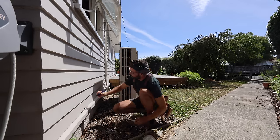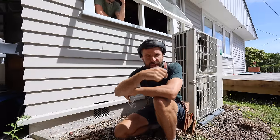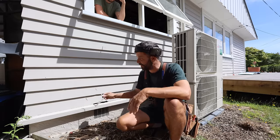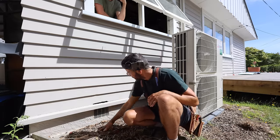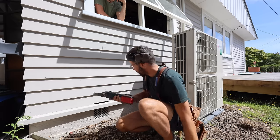So that's to this floor. Part of this bracing, we've got to screw a big bolt down into the foundation below the wall frame — anchoring the wall to the foundation. But look how close we are to the ground here. So rather than crawling under the house, I need to replace this weather board anyway. So let's go in this way.